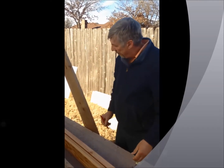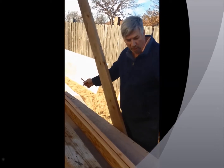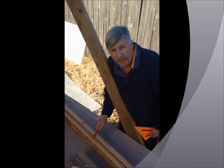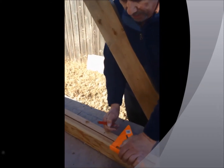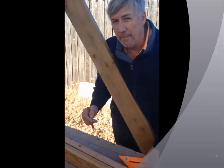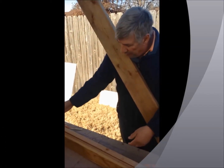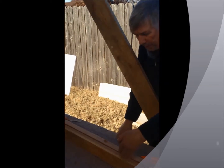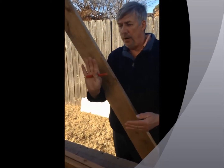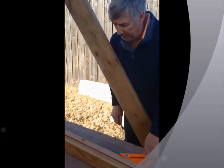So now that I've laid out this bathroom wall, you notice here that I also put a California corner. But all this is really going to be is backing for the drywall on the bathtub. So the bathtub is typically 32 inches wide. So I come here, my 32, I put a board here, flat in the wall. That way I'll have my shower, and then I'll have a place to nail the drywall. So that's what that designates.